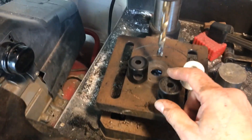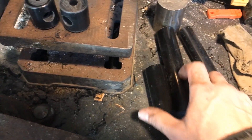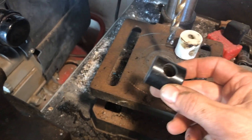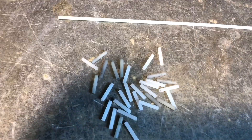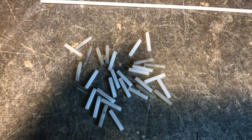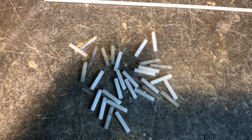I was successful with the first set — that is this bushing which goes on the ladder here. All I did was use an inch-and-a-quarter Delrin rod; I got it right on the first shot. Just drilled holes stepwise, rounded the edges, and it fits really nicely. Now I cut the needle bearings from the one-eighth inch nylon rod — 15 on each side. The dark ones are actually the originals. This is kind of hard to cut with a saw because it's brittle and doesn't really cut well. The best way I found was to just use a sharp chisel.